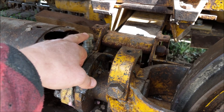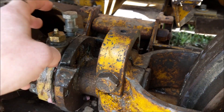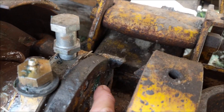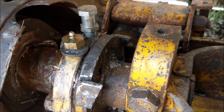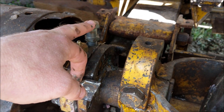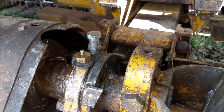I'm going to loosen this up just enough so the grease comes out down here at the bottom — I think it'll come out front and bottom, there are ports. So it's down in here; you should see grease come out. If grease isn't coming out, clean those holes out. Don't keep unscrewing this, because if that does come out under pressure, you've got some big problems.